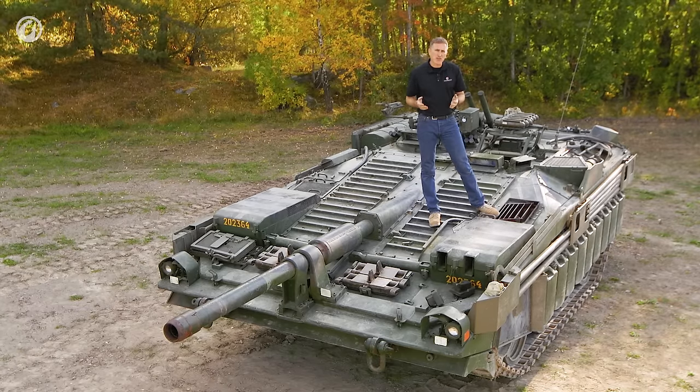There are some advantages to the turbine engine — why it was selected in the first place. The Stridsvagn 103 was the first production tank to have a turbine. The big advantage is high horsepower at very light weight. It also keeps you very warm — you can always tell which Abrams has the engine running because everyone's standing behind it in the morning. Only one moving part, low maintenance, but high fuel consumption especially when idling. At idle it's always high, but you do have the diesel engine on the other side, so you can do various low-speed maneuvers without using the turbine.